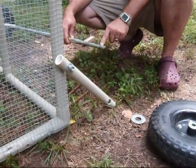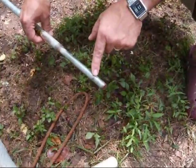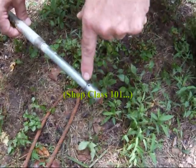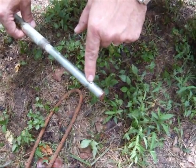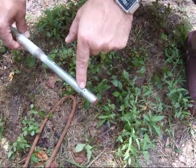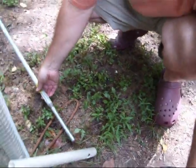You also need to drill a hole for your lock pin. I did mine on a drill press. You'll need to make a dimple to start your hole because it's a round surface, so your drill bit will walk unless you hit it with a punch to get the hole started. You can do it with a hand drill and a bench vise if you have patience and good drill bits, but if you have a drill press or know somebody who does, it will go a lot better for you. That's the axle, and I'll talk about the tire in a little bit.